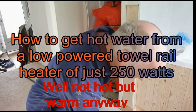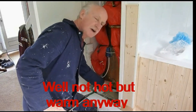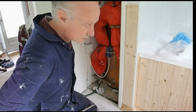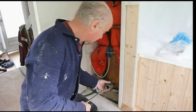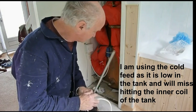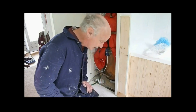This is the stage where we're going to fit this element into this tank, and it's going to go into this feed here. I'm going to drain this cylinder out with a hose outside — turn the valve first of course. Then we're going to disconnect this and using a T-piece, push it all in and make it fit. Now if you can't get this in the bottom of your tank, I'm lucky — the thickness is facing outwards and I've got enough room to clear the element.